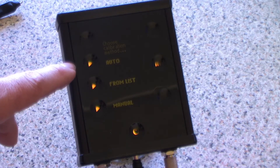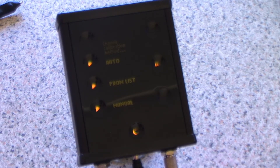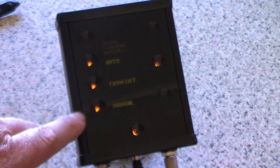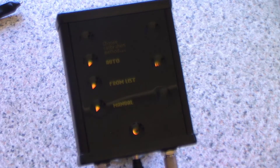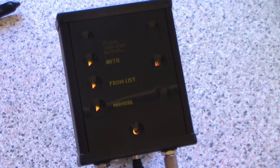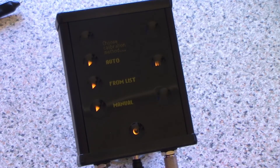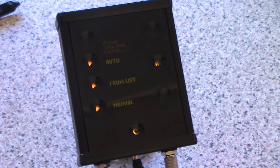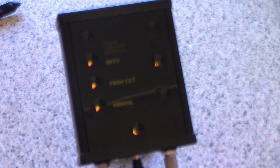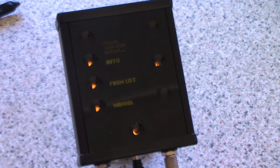You've got three choices: auto, from a list, or manual. Manual is for machines that are hard to calibrate — we'll be building up a database, and you can get the values from us or the website, program in two numbers, press save, and it manually calibrates the machine. From a list — because SwashDrive requested this power supply — we have all SwashDrives from the current Gen 8 back through Gen 4. Select one from the list and it takes you through the rest of the steps.